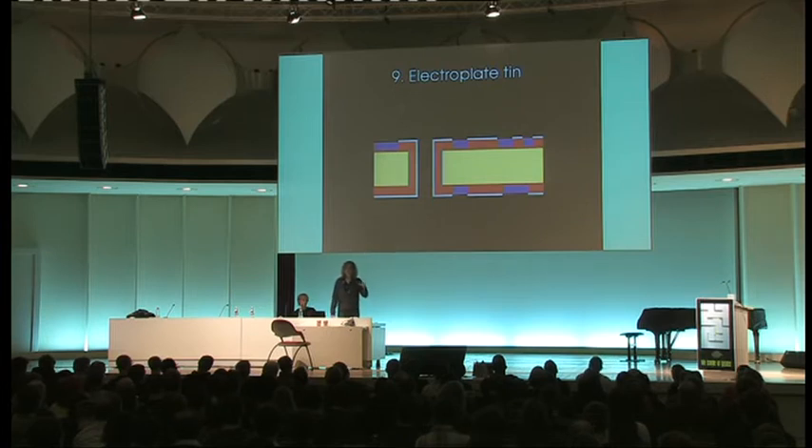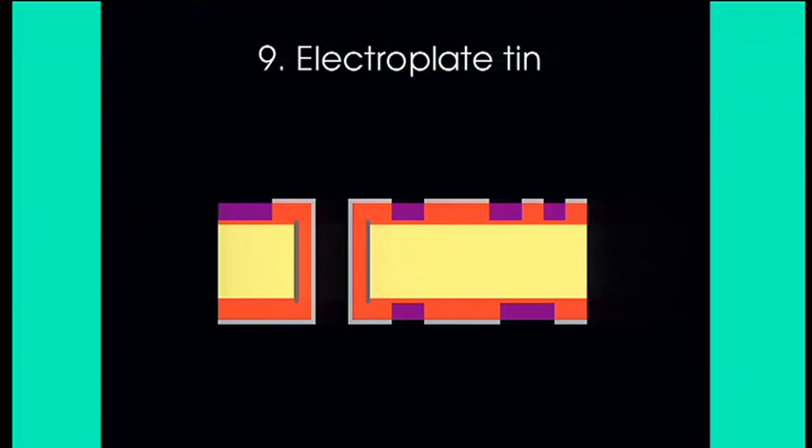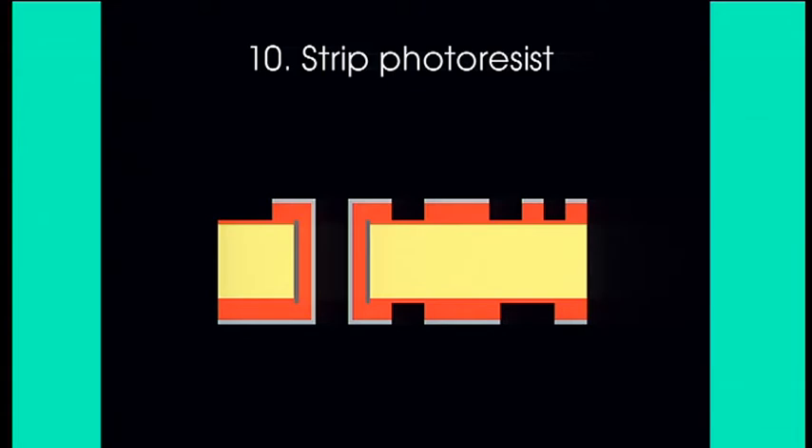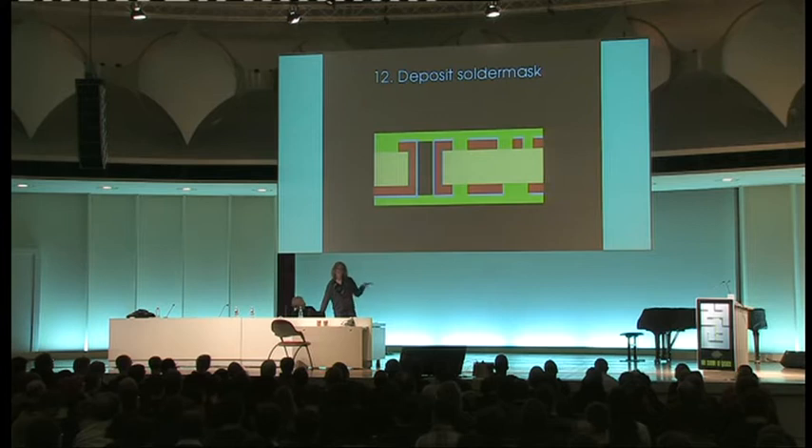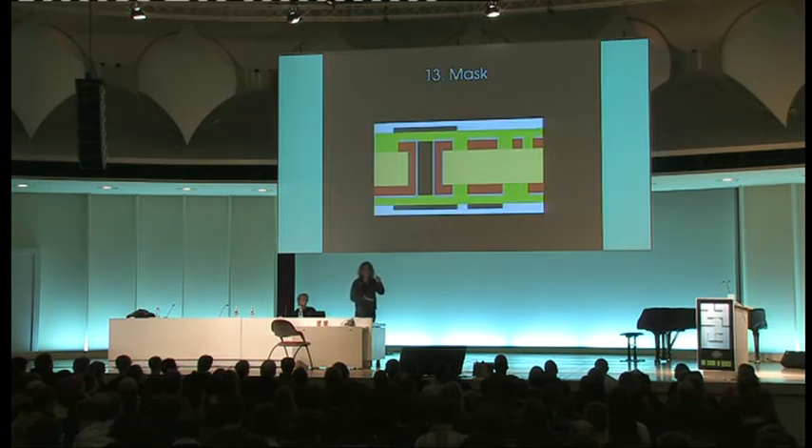Then a layer of tin or another inert metal is plated on top of the copper, and the hardened photo resist is stripped away. You now have your patterned copper image on top and bottom protected by tin, and the thin copper layers used for electroplating are etched away. At this point the finished electrical component is ready — the top and bottom copper layers are patterned. Now the solder mask is applied, covering the whole PCB completely, and there's another masking step: the solder mask is imaged in essentially the same way as the photo resist.